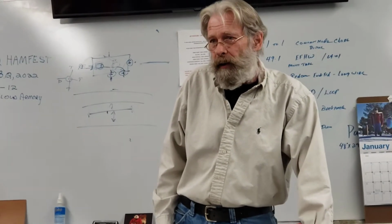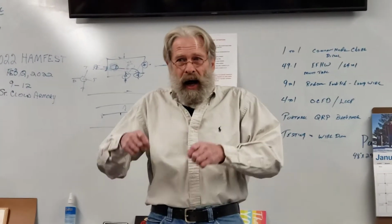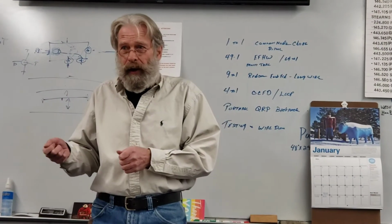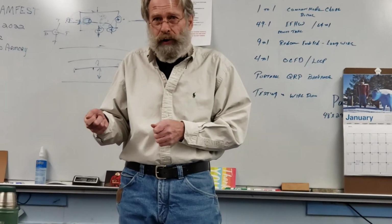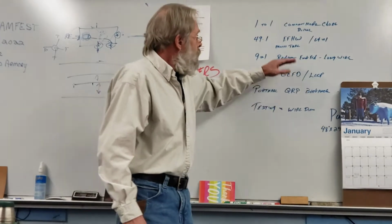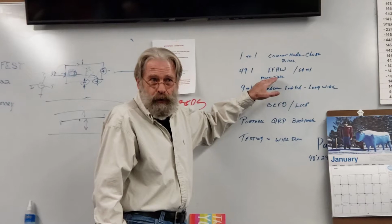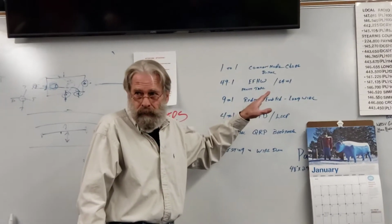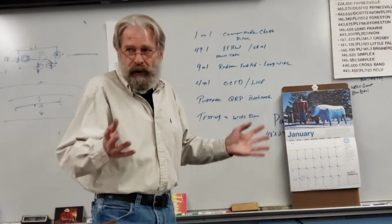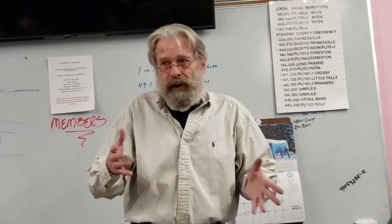And how do we tweak it? If we find something in that testing process, how do we tweak that back into where we need it? It's not always cutting the wire, making it shorter or longer. It might be, like I mentioned earlier, in that tap of a 49-to-1, maybe we need to get that back down to a 42. Take one wrap off of that. Instead of a 2 to 14, we do 12 or 13.